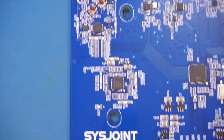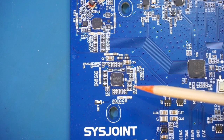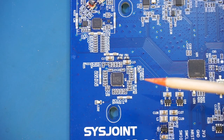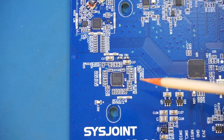Now let me move up a little bit. You can see the synthesizer used here is identical to what's in the NanoVNA-FV3, which is a MAX2870 23.5 MHz to 6 GHz fractional and integer N synthesizer and VCO. This is pretty much what I suspected earlier, given that the SV6301A has largely the same frequency range and RF characteristics as the NanoVNA-FV3.